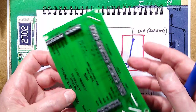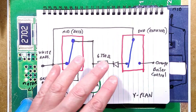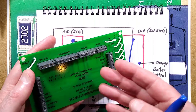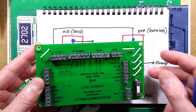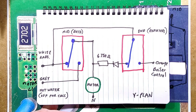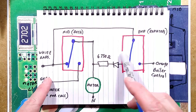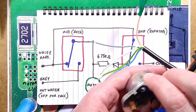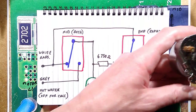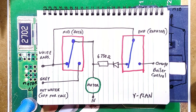I'd love to know who designed this wiring centre and how much work was involved — it's a very neat approach for a very complex wiring system. If you are wiring up stuff like this in the UK, one of these units from Screwfix or a heating supplier will save you an awful lot of time. It also makes troubleshooting very easy because it's so open, exposed and well-marked that you can go straight to a connection with a meter. Well worth taking apart, very neat inside. Also worth taking this valve apart — this motorized drive system is very simple, just using one cheap synchronous geared motor and running it in a way that stops it in different positions with the minimum amount of electronics. Very interesting, very neatly done.